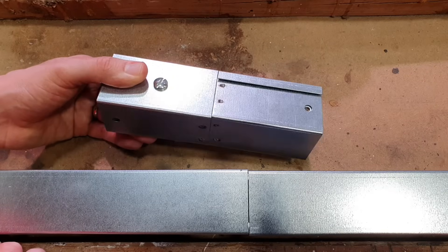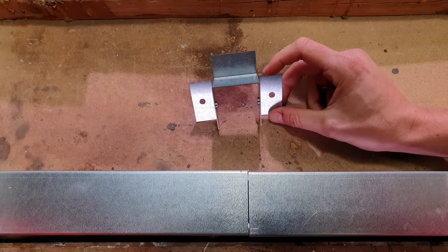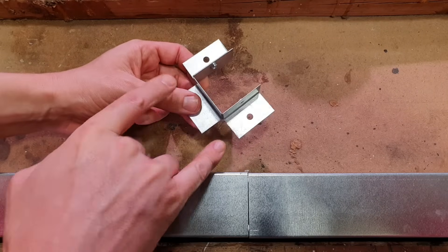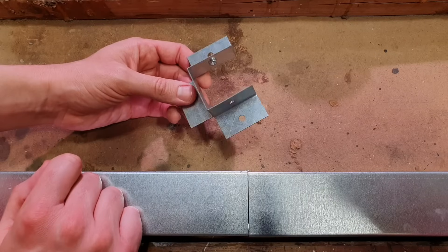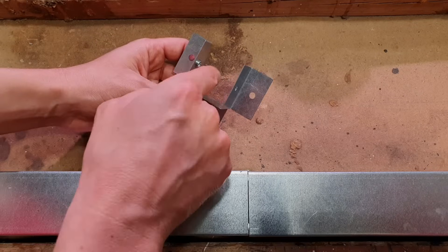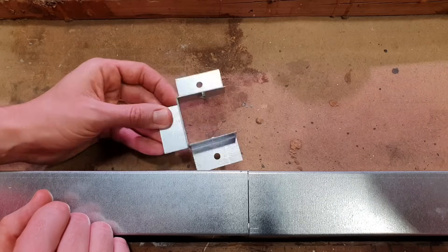It's a reminder that however long you've been in this industry, there's always something new to learn. So what are we looking at here? This is a flange — I'm thinking that would be quite good if you're bringing a piece of trunking down to a consumer unit, as a really good way of attaching that to a distribution board. If we're drilling and fixing with metal screws, that's going to help maintain the earth continuity from the consumer unit to the body of the trunking. Perhaps we're never going to cut a perfectly square hole — if we're worried about violating the IP4X rating needed on top of that consumer unit or distribution board, then this helps get around that.